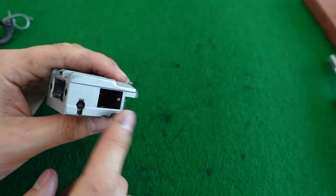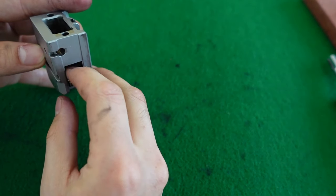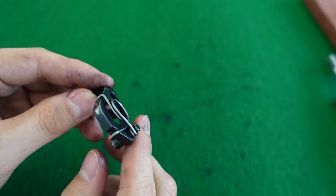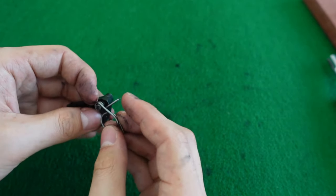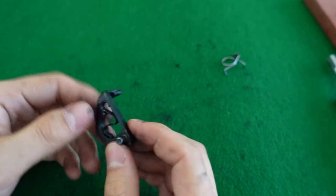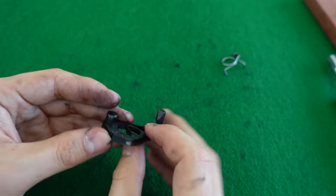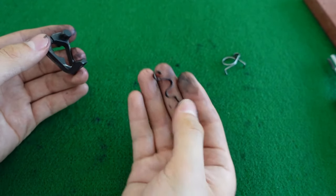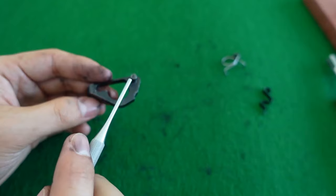The purpose of the dome-head pins is to keep the bearings in place — they have a semi-circular indent inside that allows them to rock in place without falling out. The ejector assembly has an outer spring — a silver-colored straw-like piece — and an internal spring inserted inside of the ejector. To remove the outer spring, pop it up, put some tension on it with your nail, then squeeze the legs of the spring and out it comes. Removing the internal spring is not recommended for general cleaning, but it's quite easy — you simply push it out of its groove and wiggle it out. There's another part on the ejector which is a pin firmly brazed in place, so the ejector is considered one single unit.